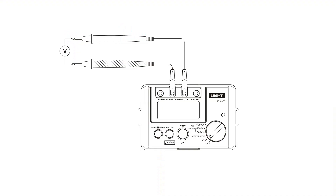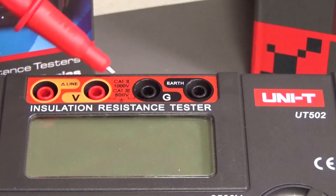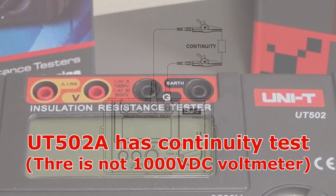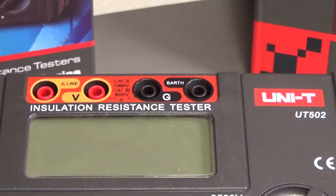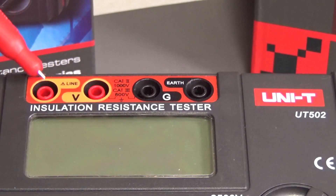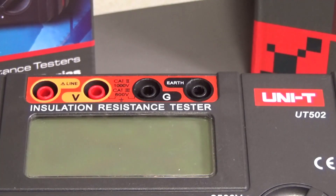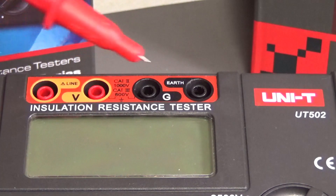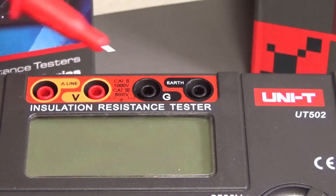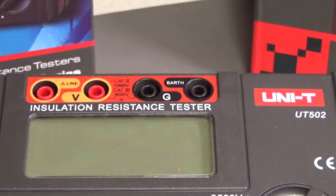Now let's jump to the test. Here inside I do the voltage reading — 1000 volts DC or 750V AC. Remember, the A model doesn't have the DC voltage reading. Here outside is where I do the megaohmmeter test with the high voltage, which the multimeter will generate.